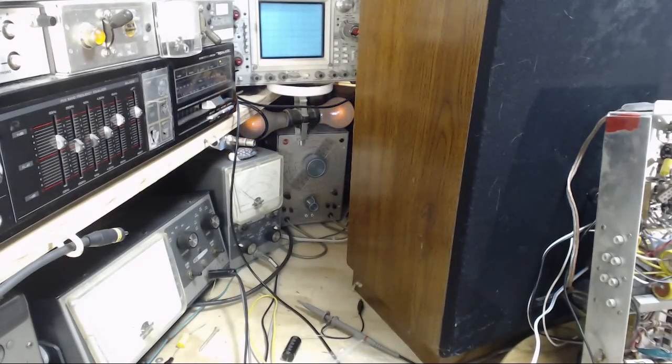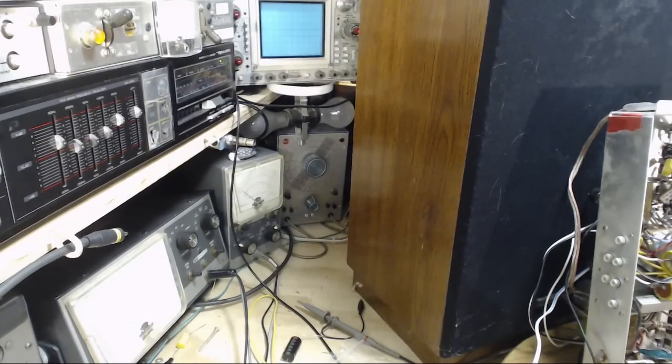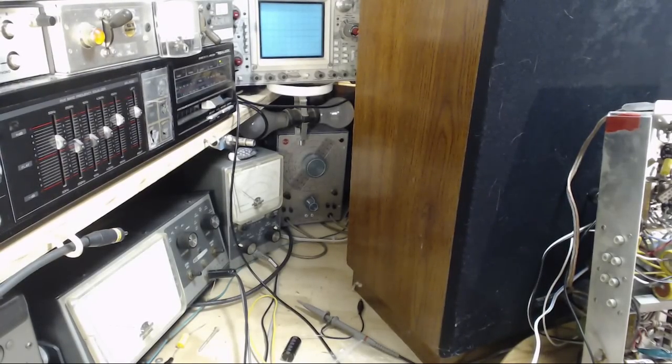Swoosh. Now that's an awful lot of capacitance in there compared to what's supposed to be there. That in itself could pop those rectifier diodes. Just wait for those lights to come back up, and we'll hear if the hum comes with it. Here they come. And here comes the hum.